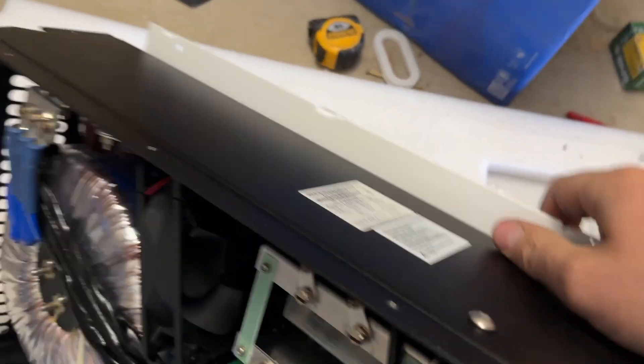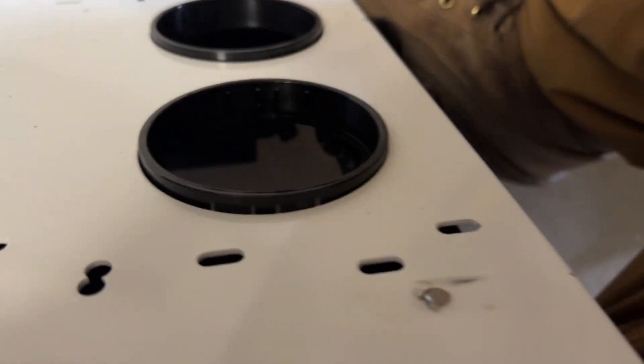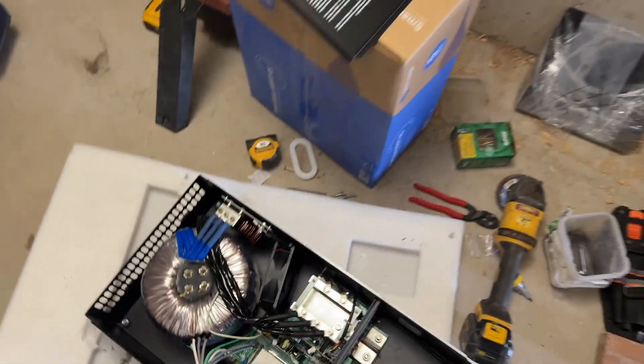If I can flip this over with one hand — when you're done, it's going to look about like that. So the screw comes through the metal and it's ground off, nice and smooth. And that way, you don't have any sharp points reaching into the wiring box.